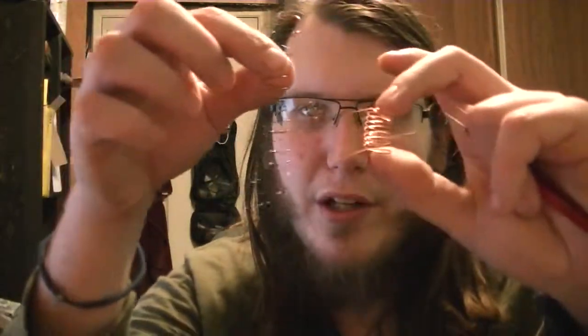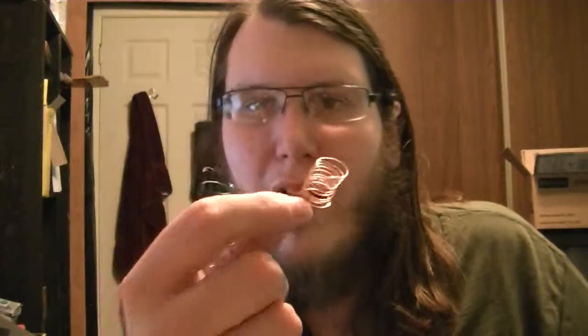That's basically all I worked on. It took me a while to get the wire right — I had to hand wrap resistors. I tried different wire thicknesses; of course, the thicker the wire the less resistance per turn. This thick stuff was way too little resistance per turn — it would have taken like a hundred-something turns just to get to a quarter of an ohm, which is what I need. Once I have this circuit working, I'm going to post the schematic so that if you ever have a LiPo battery, you can easily order this chip and build yourself a charger in about ten minutes. It's a very simple circuit — that's why I'm confused, because there's not a lot to go wrong.